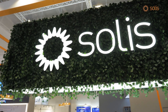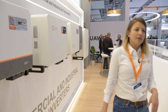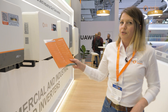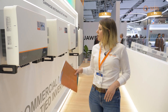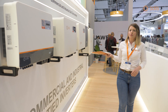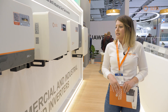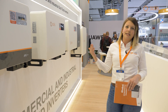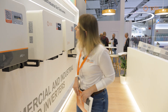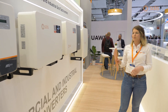For the next part we have the commercial and industrial grid-tied inverters. The C&I range is quite interesting. We start from the 30k, which was launched last year — it's the 5G series. What we have new now is the 50 kilowatt. We have 50 and 60 kilowatt models with up to six maximum power point trackers, and this one also has 16 amps maximum current input.